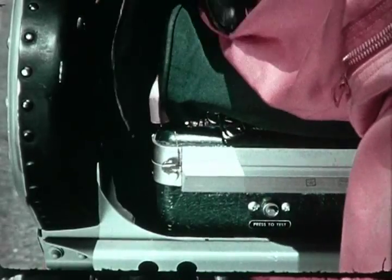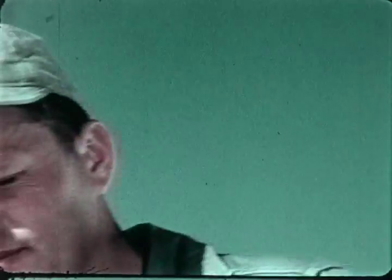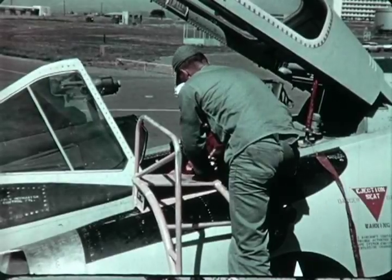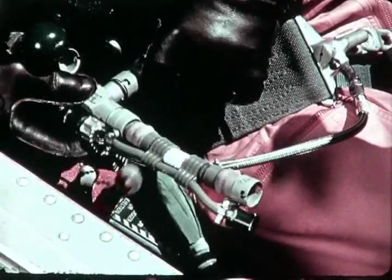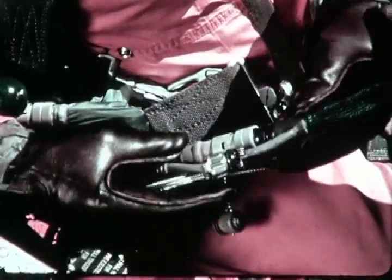He checks the lock wire that holds down the emergency release handle, then makes certain that both harness attachment wedges are locked into their assemblies. He connects the bladder hose of his partial pressure suit to the bladder port on the side of this T-fitting in the personal leads assembly, and the suit's capstan hose to the hose connection. The hose from his helmet faceplate is connected to the hose extension on the T-fitting, and the communication and faceplate electrical leads are hooked up.